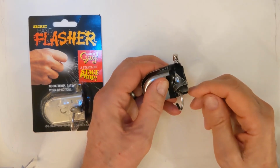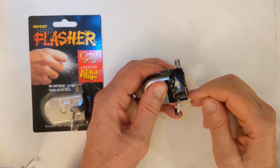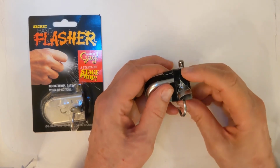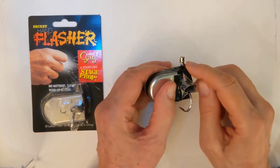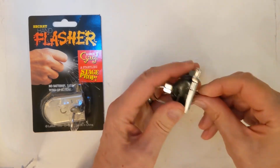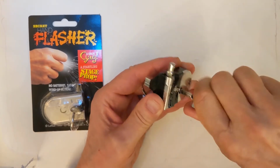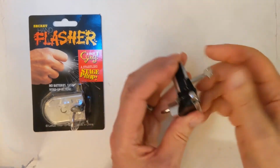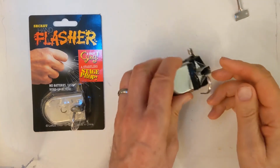Now it's remotely possible it could be a combination of both. Maybe the little metal tab was worn ever so slightly and the spring had lost its tension. But anyway, putting a lot more tension on the plunger spring has totally solved the problem, because I can wind this thing up now and the inner coil spring is not triggering prematurely. So that's a good thing. Here we go. 1, 2, 3. It's working good now.